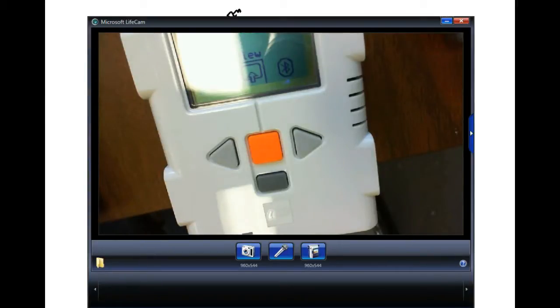So you want it to follow that white line over there. Well, how in the world does the sensor know what the white line is and what the floor is? So you go over there and see what it puts out, right? If it sees the gray, we want it to turn back into the white. Well, what we have to do is calibrate our program to say, okay, what is white and what is dark, right?